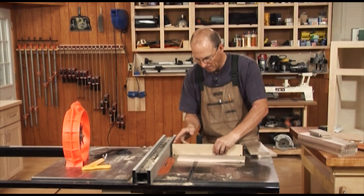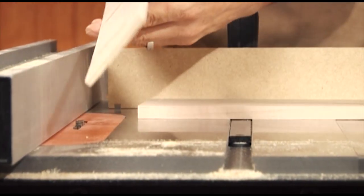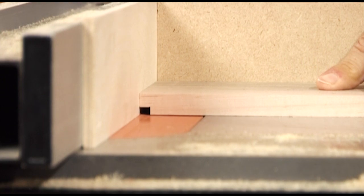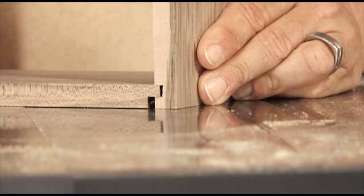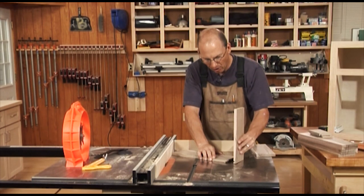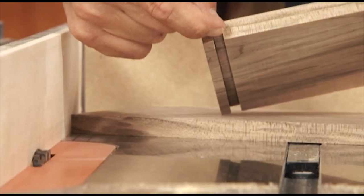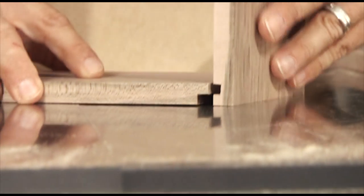I'll need to move my miter gauge extension back. I'm going to add a one quarter inch thick face to the rip fence and stick it on with double face tape. This makes a perfect length rabbet cut. We're not quite there yet — we need to raise the blade to get that to fit. I'm going to make one more little height adjustment, and I'll also need to recut this joint. Because I've changed the height of the blade, that will make this cut deeper, and everything will come together.